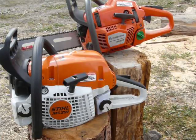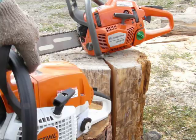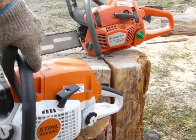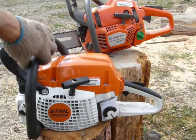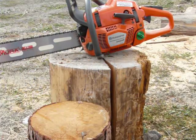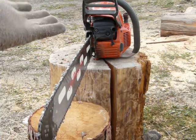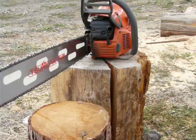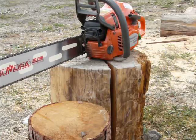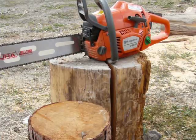They're both dual ported exhausts. You can see I rhinoized the MS-291, and we also did some bad boy black on the muffler — we're doing some experimentation. I kind of like the way it looks versus the stainless. You can see we have two tubes coming out of the exhaust on the 346, so there's no flow encumbrance whatsoever. The flow is a little bit better; I'm giving up six CCs — we'll see how it does.